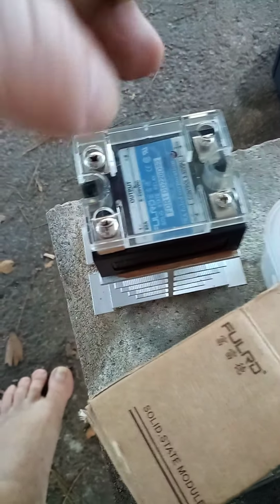But like I say, the other solenoid that's in there now, it was working when I first put it on there, but it was clicking back and forth for a bunch of times. And then during the night, once I got it set, it was working whenever I went to bed, and then the next morning when I got up, it's not working. But these, no matter what you do with them, whether you got the light on or off, it's still got voltage going across the two here. And so does this one. Both of these are brand new. Took them out of the box. Even got a heat sink for this one.